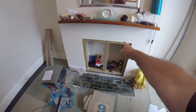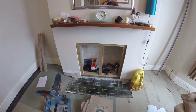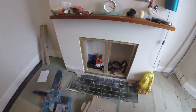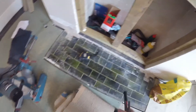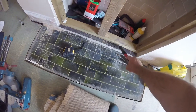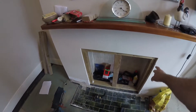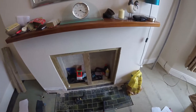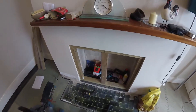What I've just done is made a basic frame to fit in this hole where the chimney, where the fire was. The wood is fixed to each other with screws and glue but it's not fixed in the hole yet, because I need to make sure this gap between the front edge is enough to take a couple of pieces of leftover triple flooring — I might as well use it up — and then a piece of plasterboard on top of that. That's 22mm plus 9.5mm for the plasterboard.